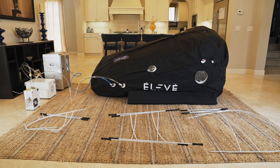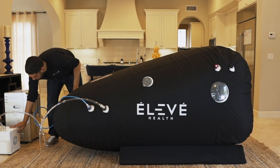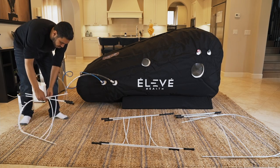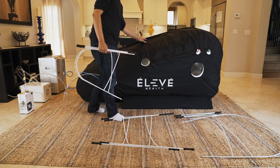Once chamber is fully inflated, confirmed by audible and physical airflow exiting the chamber, turn off the dehumidifier and compressor and turn air valve to open. This will deflate the chamber. Important. Always wait until the gauge hits zero to unzip the chamber. Unzip and open the chamber.